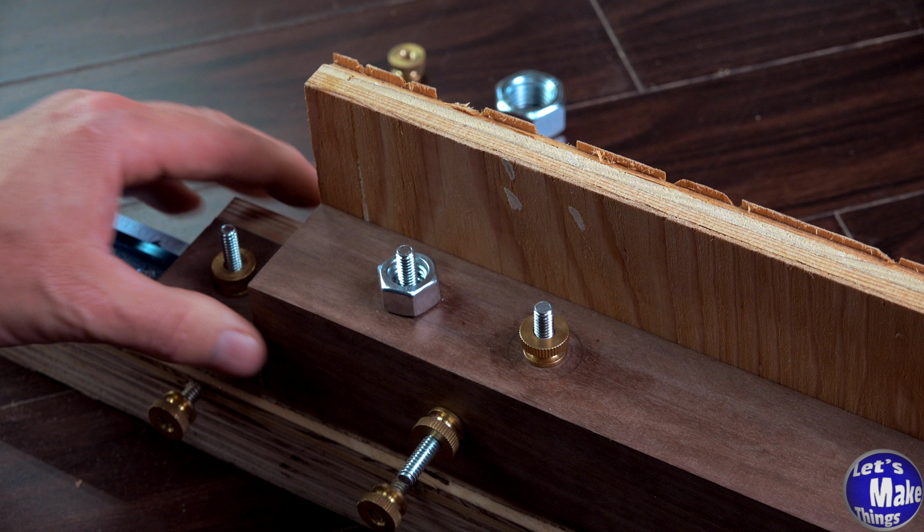If you saw my bite size, you might be thinking why I made a full-size video with this. The reason that I did was I wanted to show the different sizes that you could use. I found that every time you take a nut and you add 1/4 inch to it, you can use that size and press it in. So if I have a 1/4 inch here, this will work in a 1/2 inch. If I have a 5/16, that'll work in a 9/16. If I have a 3/8, that'll work in the 5/8. If I have a 7/16, that goes to the 3/4 inch. And then the 7/8 will do a 1/2 inch.